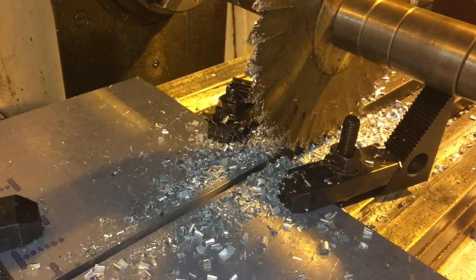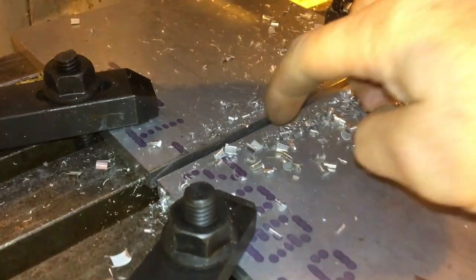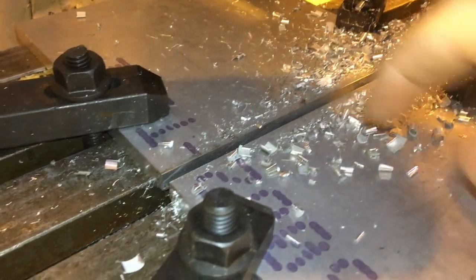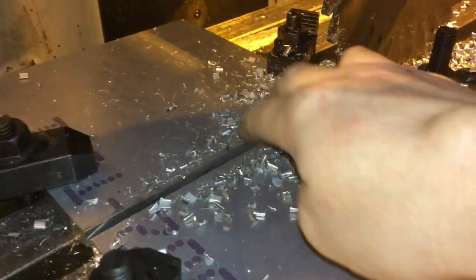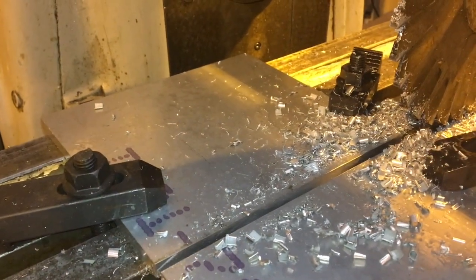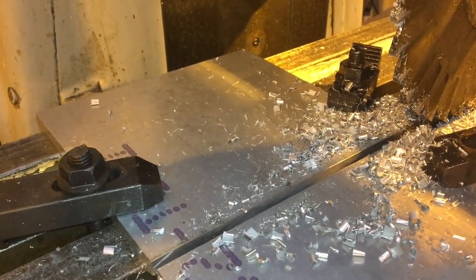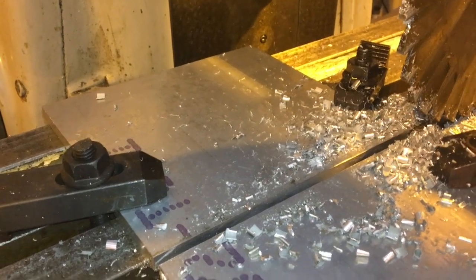And that was nice and painless. It's wasting a bit of material but I want a nice square edge. That worked out in the end — 100 RPM and two and a quarter inches per minute, through that in a couple of minutes. Nice and quick, nice and square. Next thing is to set it up in the lathe and bore it, so that's what I'm going to do.